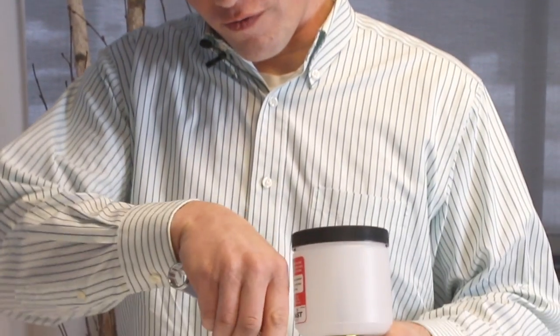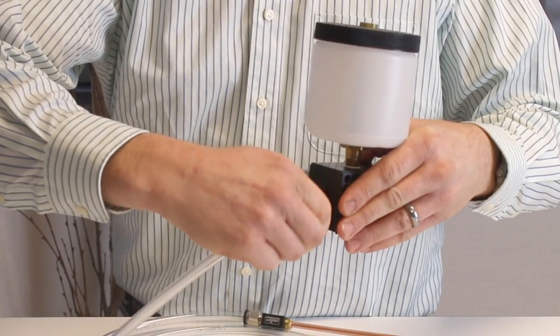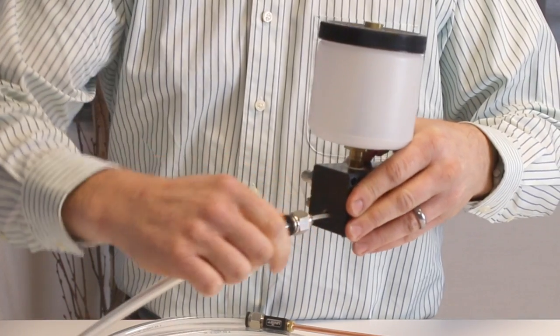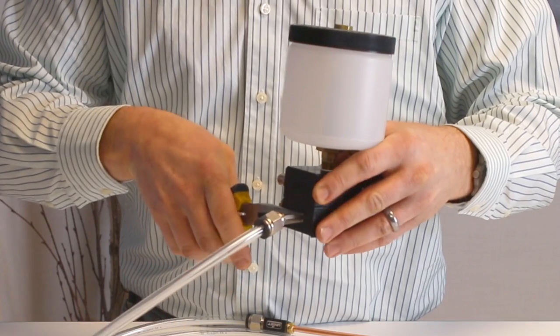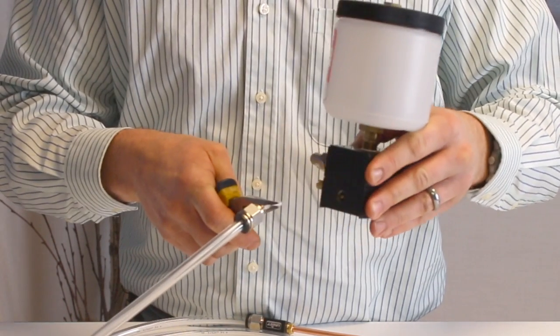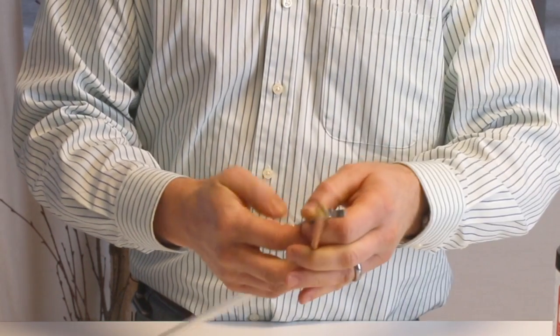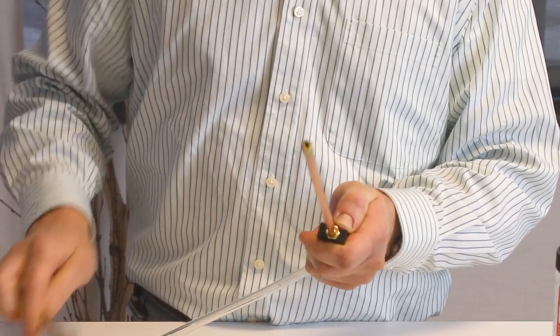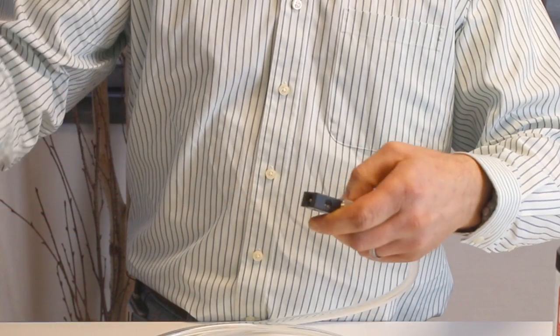Now we're going to talk about completely replacing the coaxial hose when used with the redesigned capillary splicer. We'll begin by removing the push-in fitting from the pump block and pulling that back to expose the capillary. Using a pair of needle nose pliers, pull the capillary from the barb fitting on the pump. Next, we'll remove the nozzle from the coupler block, loosen the screw, and pull the capillary from the splicer.